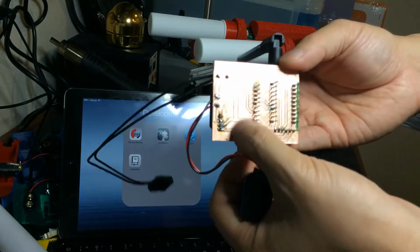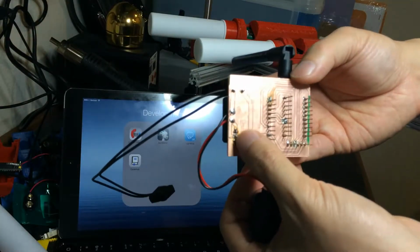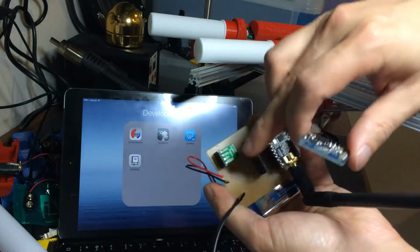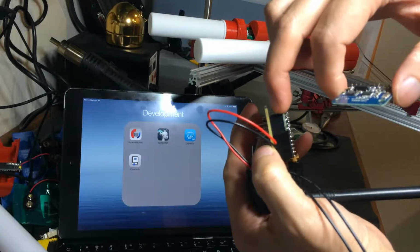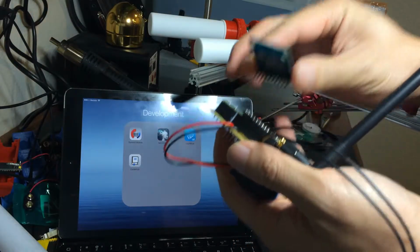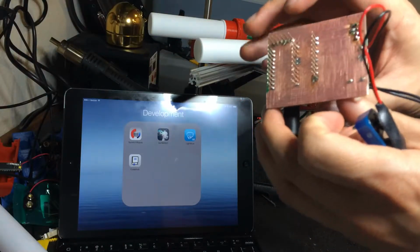It's very fast. So I don't have to wait for the turnaround time, but it's really quite difficult to solder stuff onto this isolation routed board. The amount of copper is just tremendous, and you put tons of heat on the pin. So if you look at this breakout board, actually, let me turn it off momentarily, you'll see that there's this power supply here. I burned out two of these power supplies trying to solder it in before I switched and first soldered in the jack here, the female header, and then putting the 3.3 volt regulator onto the female header.